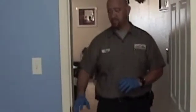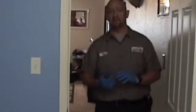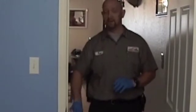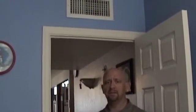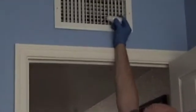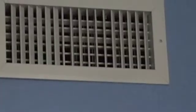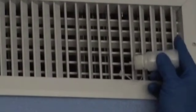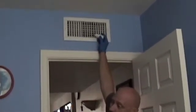This is dust and dirt being brought in, or just as bad, nice air-conditioned or heated air that you're paying for that's going to be shoved outside. This is a big part of energy efficiency — getting rid of these leaks. You can actually feel air being brought through the ductwork. Mind you, when we first started this, we turned our heating and air conditioning system off in order to do our test. So that is air being drawn in through the ductwork through duct leakage. And as you can see, it's almost as if the air conditioning is on — you can see the puffs of smoke being actually drawn away from the vents. That is due to air being infiltrated inside the ductwork from an exterior source. So that's more wasted energy, wasted efficiency, and also wasted comfort.